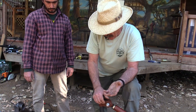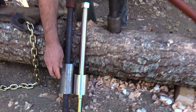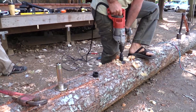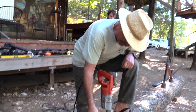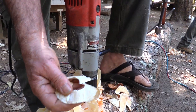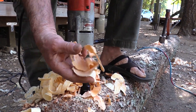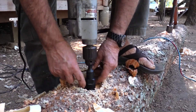They like to do it this way, and this is more expensive to make — more expensive to put on there, so these cost more. This is our sapwood. We've gone through our sapwood and then we get into the redwood. Doug fir is red fir and it's because the heartwood is red. So we're starting to get into that and we want to go in three inches.